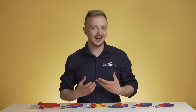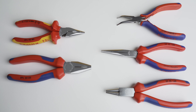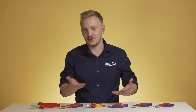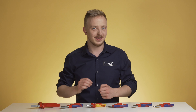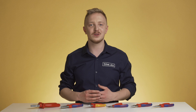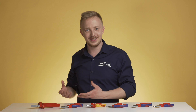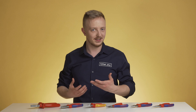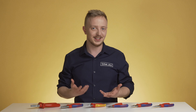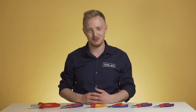For gripping and holding, you can either go with combination pliers or a dedicated gripping tool — both have pros and cons. First, you can't cut with gripping pliers since there is no sharp blade, though you might say that's good because you won't accidentally damage anything. Having a dedicated gripping tool also means you can have round or half-round jaws, which are more useful for bending and looping wires as well as reaching into tighter spaces. On the other hand, you need to carry a second tool for cutting — but that other tool can be dedicated to the material you're working with and will be more effective than the universal cutting edge of combination pliers.